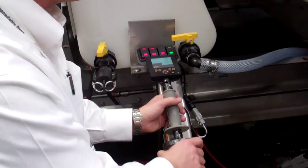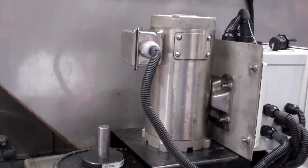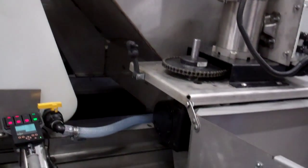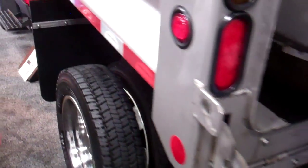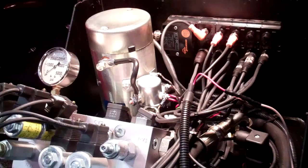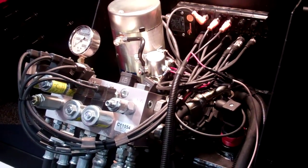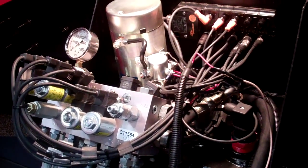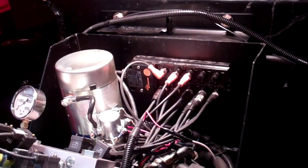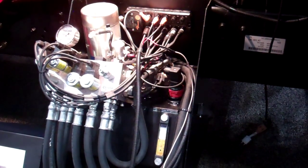What powers this system — as you can see — we have basically an electric, pre-driven hopper spreader. The pre-wet system as well is driven by an electric motor, and there's an independent motor for the conveyor drive as well as the spinner. Moving forward, this is the heart of the Clean Power Series charge system — a hydraulic pump reservoir assembly and the manifold that will power both your snow plow and your dump body cylinder. It also has an area where all the connections are made to the in-cab control and the electrically driven spreader and pre-wet system. This is designed specifically for snow and ice applications and is made only for Henderson Manufacturing.